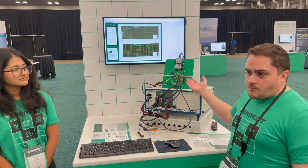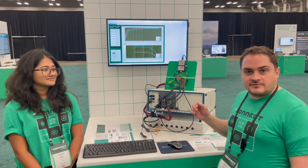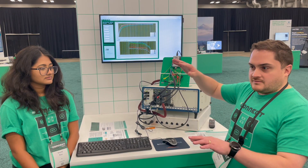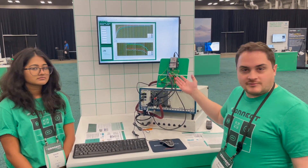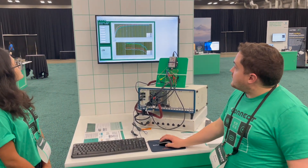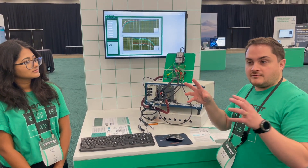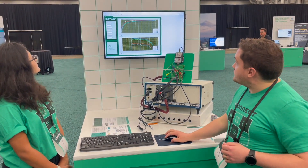This is one of those fancy ones where you can reconfigure it through I2C. What this demo is going to do is configure it to output a specific voltage, and then we are going to test it with our system. This first test is doing a DUT efficiency, where we supply power to the DUT and then draw power from it, and we measure the difference to see exactly how much is being lost.